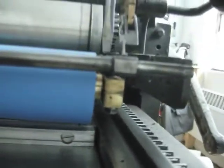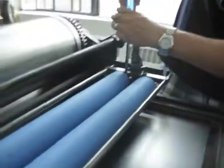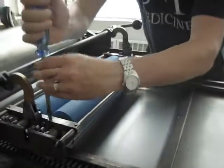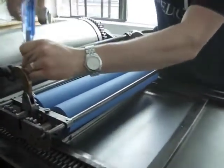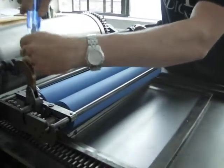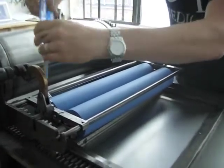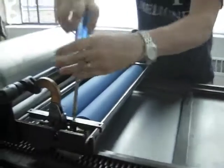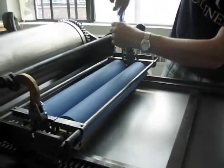So we loosen them up. They're pretty long screws, so it takes a little while. You want to do it a little on each side at a time. That lets them down evenly, so you don't put extra pressure on the bolts and the threads themselves. You don't want to strip anything because, well, replacements aren't that easy to come by. Go slow, and if it starts getting tight, switch to another bolt and work on that for a little bit.